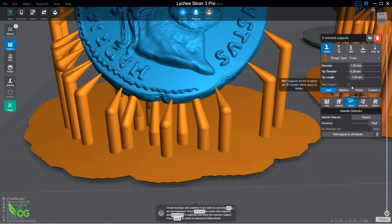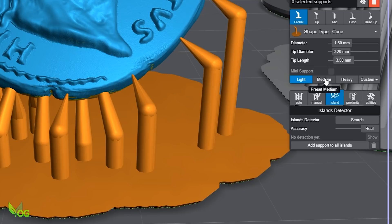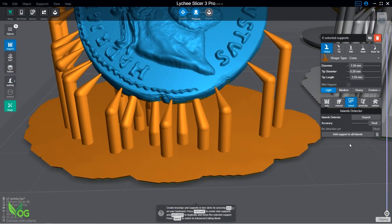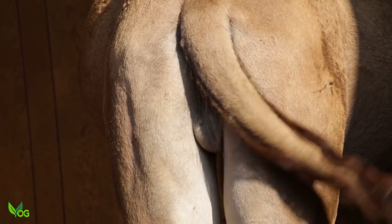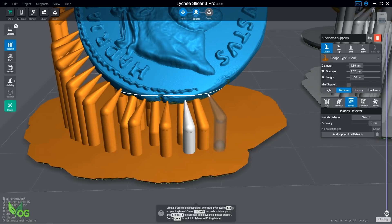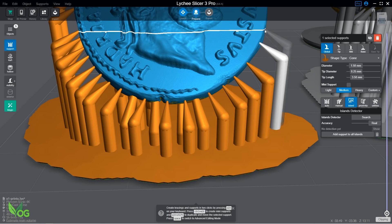I prefer fine and medium supports. With Lychee, these contact points are 0.2 and 0.25mm. Even the heavy supports only have a 0.35mm contact area, so straight away none of these are suitable for X1. That means all supports will have to be custom at 0.4mm and above. Well, I'm always a bit daft, so I pretty much ignored the instructions, scrapped the light supports, increased the number of medium supports, and decided to have another bash.